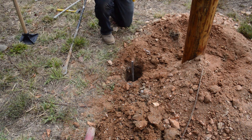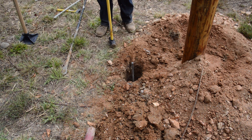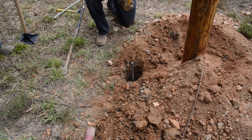You're supposed to get it to grade. Our inspector wanted the top of the ground rod to be below grade, but we just kicked dirt around it to make it look that way. You can't cover it up until the inspector comes and looks at it. Once all that's done, it's time to wire it up, and that's the subject of our next video.